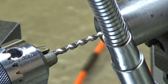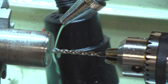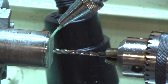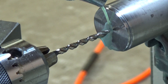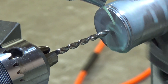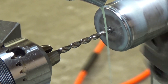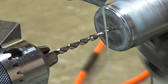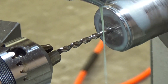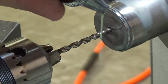I'll turn on the coolant here and see if we can get something flowing. The machine's set for 70 RPMs, and we'll just give this a try — you'll be seeing it as I see it. Here we go, 70 RPMs, we'll just start pecking away at it. I'll just get a curl coming off and pull out of it, let it cool off, come back into it.